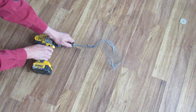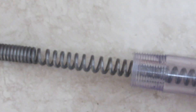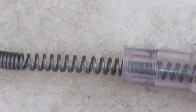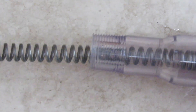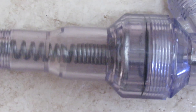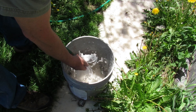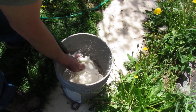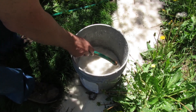You can alternate between forward and reverse to sweep right or left. High-pressurized flowing water shooting out the end of your dip tube quickly sweeps the suspended chunks of sediment to the mouth of the tool. This pressure forces the chunks up against the spinning auger. The auger busts them up, pulls them inside, and prevents plug-ups. Once inside, the sediment is ground further in the grinding chamber with the water to produce a fine slurry that is discharged out through the garden hose to a remote disposal location.